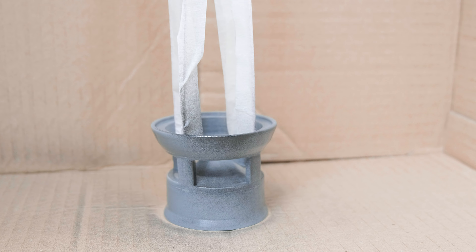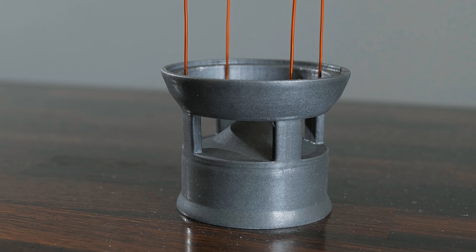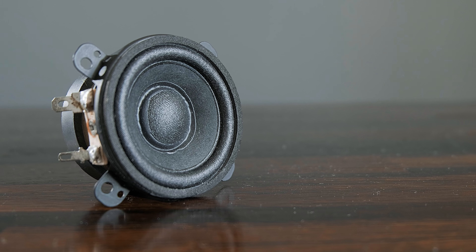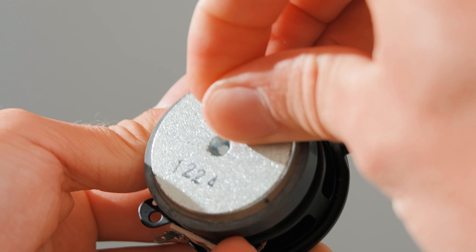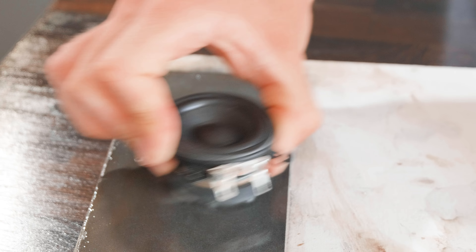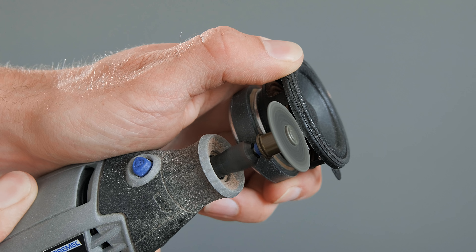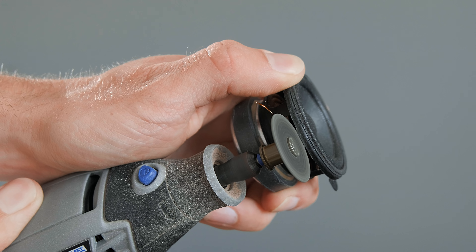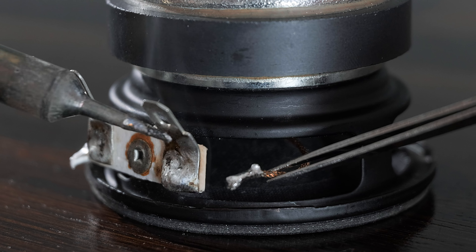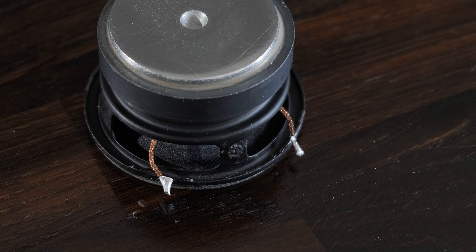It can now be sprayed with plastic primer and then painted any colour you like. I've gone with a thin spattered coat of matte black, which makes it look somewhat metallic. Now it's time to add the speaker, and the one we're going to use is a 2 inch full range driver that's fairly inexpensive yet sounds great, a link to which you can find in the description. As the back of it will later be visible through the glass, we can neaten it up by taking off any labels and then using some fine sandpaper and water, followed up with metal polish, to give it a more shiny appearance. We can carefully remove the mounting brackets with a rotary tool, ensuring that no particles bounce into the interior of the speaker, and lastly we can remove the ugly connector rail. The speaker on the whole looks a lot more presentable from the back, and can now be mounted into the base.